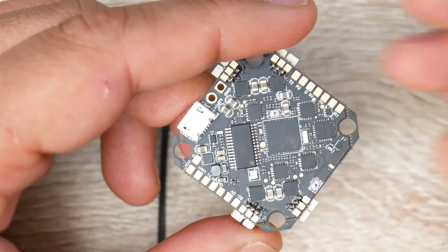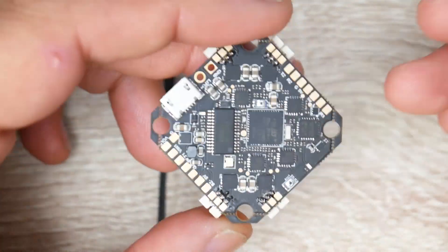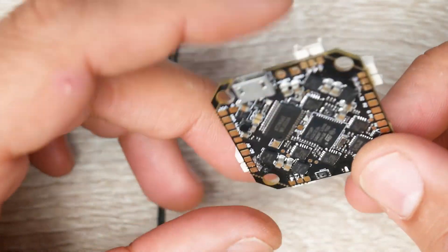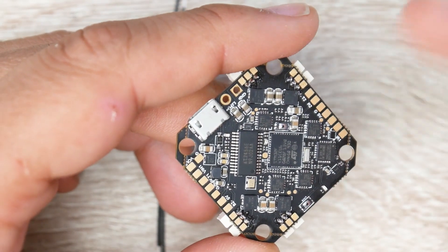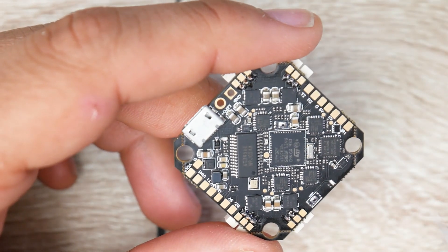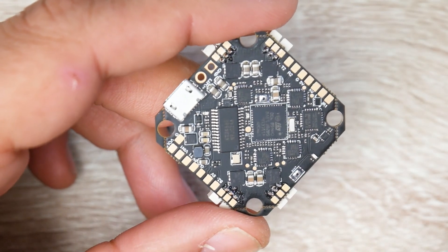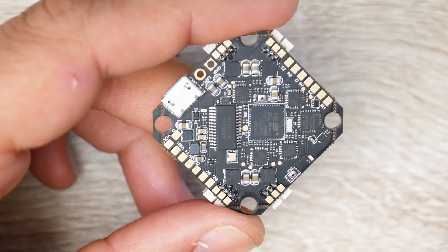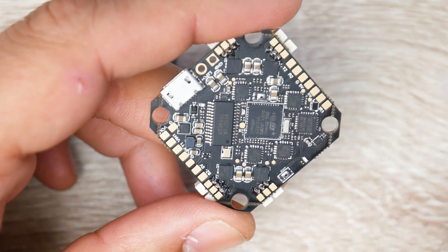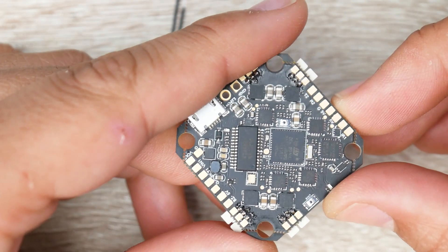If you're going to install this board, I'd highly recommend you add a low ESR capacitor because the filtration is very minimal. If you're running SBUS or FRSky you'll be able to use the built-in receiver without installing a separate one. However, the built-in receiver only works on FCC variants of the firmware. It works on both D8 and D16, but I'd recommend running D8 because I've tried D16 on these and the range is quite horrendous.